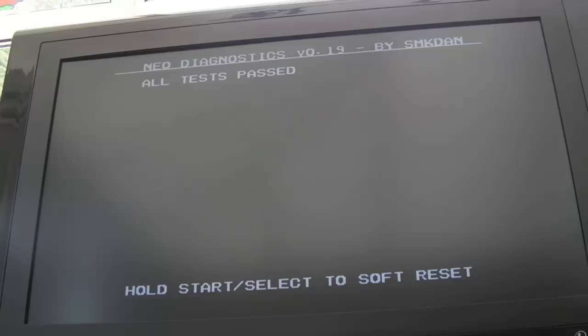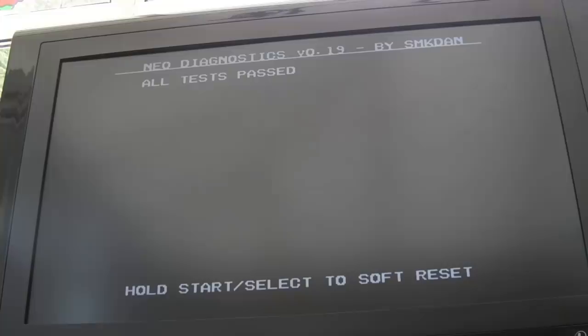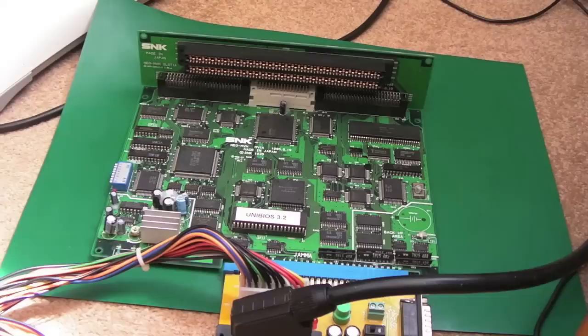And then when we fixed the SM1, we got past the SM1 issue. There was no complaint there about the IRQ again on the YM2610. All we had was a difference on the Z80, which, let's say logic dictates, maybe we put a faulty Z80 on there, and that's exactly what's happened. We swapped back to the original Z80 and it's fixed, so all this needed was an SM1.